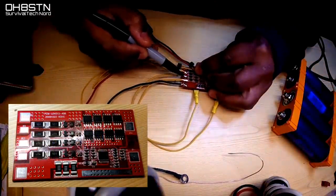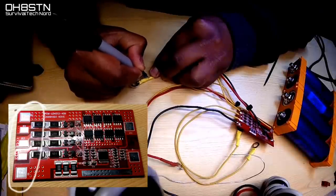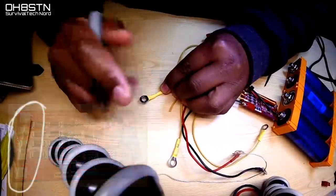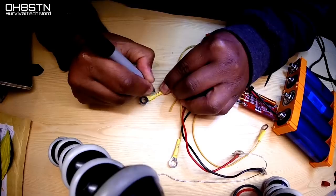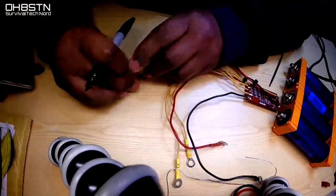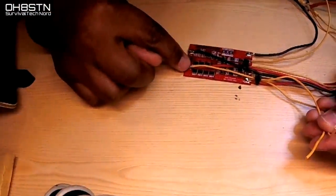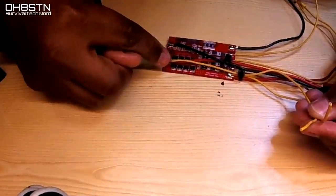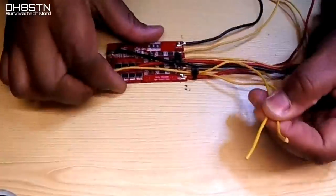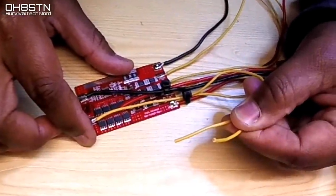Now we're going to prepare the BMS and the wires for shrink wrapping. The battery side of the BMS is marked with battery plus, battery three, battery two, battery one, and battery minus. We're going to mark the balance leads to correspond with those marks on the BMS board. This way, after we shrink wrap the BMS and bundle the wires, we know which cable corresponds to which port. I've also included two jumper wires for the reset switch — I'll put a link to last year's video showing the point of this reset switch.